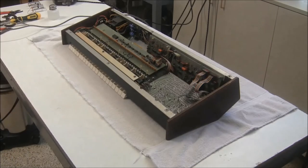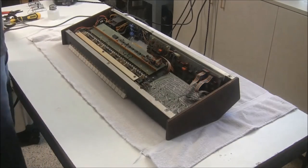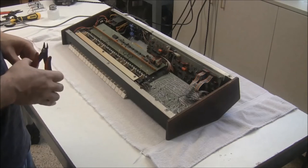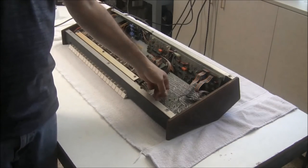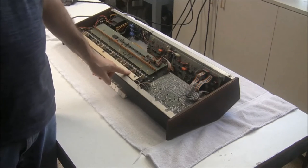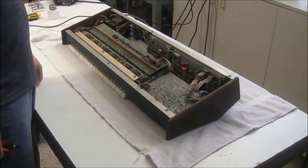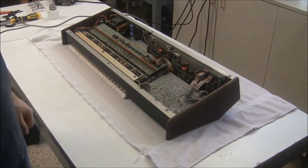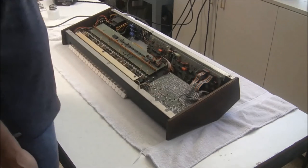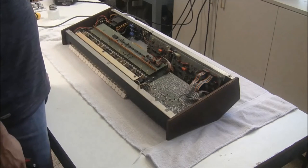So now we're going to install the LED sliders. And to do that, we're going to remove this board A. And on the early Pro DGXs and all Pro Soloists, there's no connectors for these wires here that go to the touch sensor bar and to the output jacks. They're soldered in, so you either need to pull the board and work on it with the stuff still connected, or you need to disconnect this and solder it back in when you reinstall the boards.